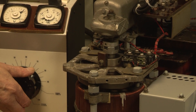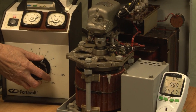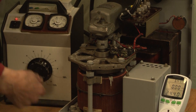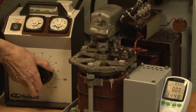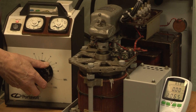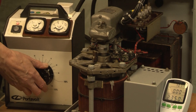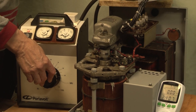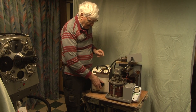Increasing the voltage now, and the Variac is following the input voltage changing and correcting it nicely. We're now back to 240 in, and we can go to an overvoltage situation. That's now 260 in, and the output is still at 240. The Variac has actually come round and hit the high voltage limit switch, so I'm just going to bring it back a tad off the limit switch. It will deal with reasonably rapid fluctuations of the input voltage, which might be caused by a change of load. With a long piece of wire from some convenient generator or main supply, as the load changes the voltage supplied to the vehicle changes — and that's what the AVRs are correcting.